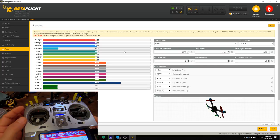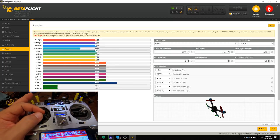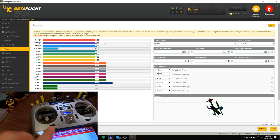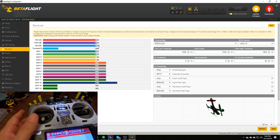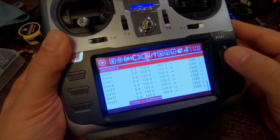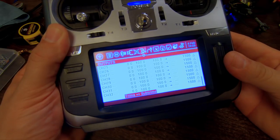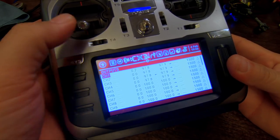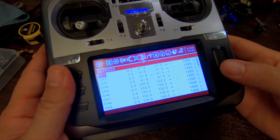The other thing I need to do is adjust my channel centers. In this case the centers are all absolutely correct — we want to see channel centering at 1500. That doesn't matter so much for throttle since it's not spring-loaded and doesn't have a real center, but for the other channels, if they're not centered at 1500, you'll use your trim switches to adjust them. Once you've got the trims adjusted so the channels center at 1500, go down to the bottom of the screen, highlight 'trims to subtrims,' and hit click once so it beeps. That will adjust the subtrims so all your channels are centered. You always want your trims centered — the trim switches are a convenient way to enter the subtrim.